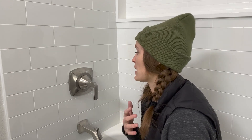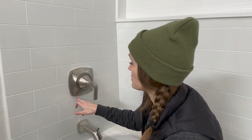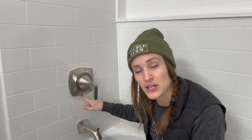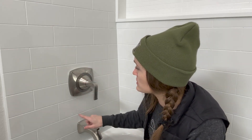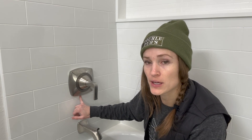You should not have to caulk this because you have that foam gasket in there, but I'm still going to caulk it — especially because most of my properties are rental or short-term rentals and I want to be overly cautious. I'm going to do silicone caulk all the way around this, except for the bottom. There's a little weep hole down here — if you look underneath, you can see it. What that's meant to do is, if any water gets behind here, it can drip out rather than get trapped and go back into your wall. So always when you silicone around something like this in your shower, leave a little opening where the weep hole is so it can drip if it needs to.